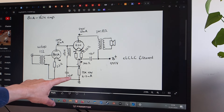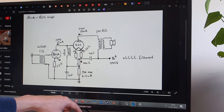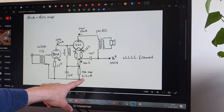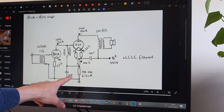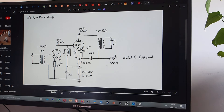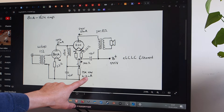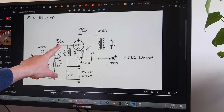Here's the ultra-path capacitor — the values I used are simply what I had available in DC link capacitors. The dropper resistor creates the voltage divider: of the 28 milliamps through the output tube, 15 milliamps takes one path and 13 milliamps the other.